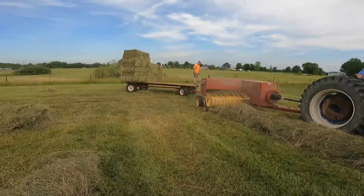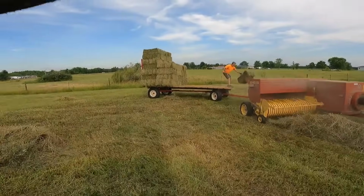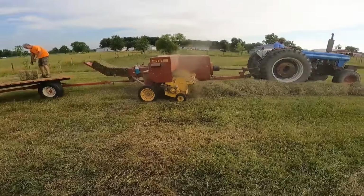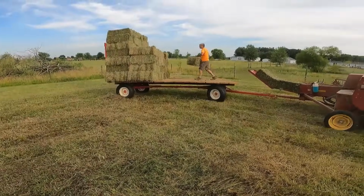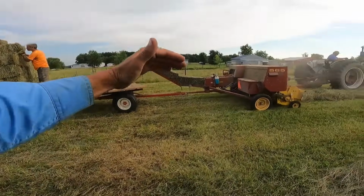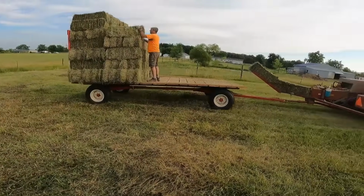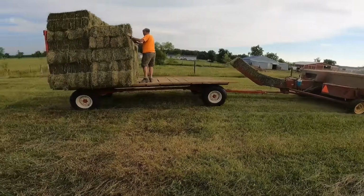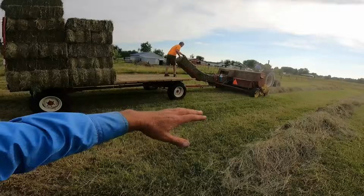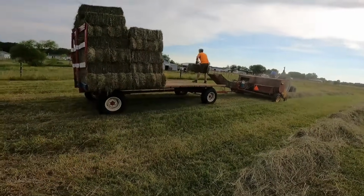Oh yes. We almost watched Sam eat it there. You gotta be real good with the clutch and make sure your stacker isn't over the chute when you stop, or else they're gonna eat it. You gotta try to be vigilant of that. I think the best time to stop is while they're walking, because they've got momentum different than, say, the wagon and the baler.